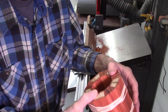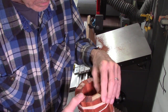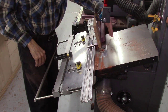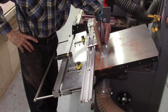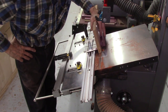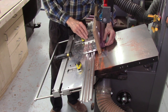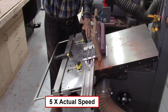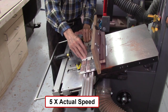The angle was set to 72 degrees and looks pretty close, but may need to be a hair larger. For the next project I changed the blade angle to 18.1 degrees since it was just slightly off. I aligned my board, made a cut, turned the board 180 degrees, did another cut, and the blade goes right in the kerf — so it should be perfect. After cutting the purple heart boards, I repeated the process on the third set, and all boards for this project were cut at 20 staves per ring.